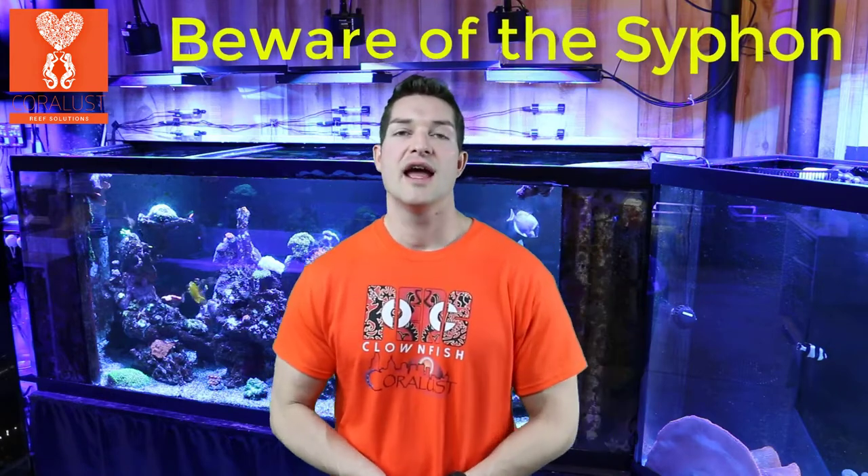So you have to be careful about those water levels. I always recommend that people put in some kind of stop — some kind of flapper or something in your drain or return line — just to keep your water level from dropping at all when your power goes out or your pump shuts off.